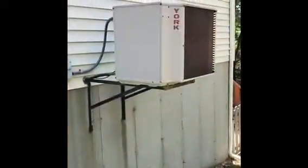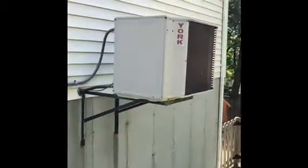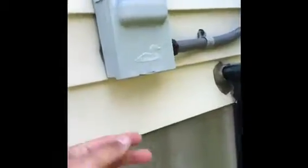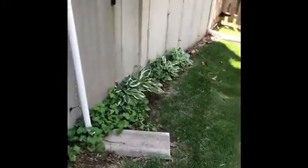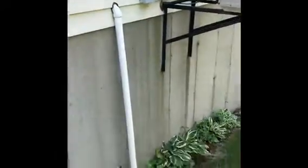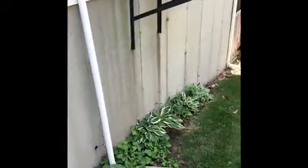We're at the matching condenser for that unit down in the basement — this is a four-ton AC. The disconnect box is right here; we'll put a new disconnect and whip in with a fuse disconnect out here. Since it's an open basement we'll go ahead and replace the line set, because I'm going to suggest we put the new unit down on the ground to get rid of the vibration — that's one thing the customer has complained about. There's a lot of vibration in the house whenever this unit kicks on.